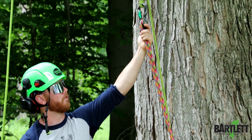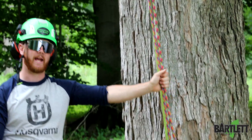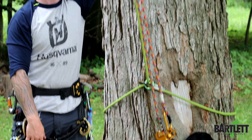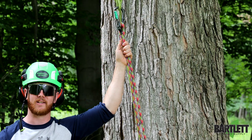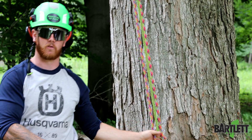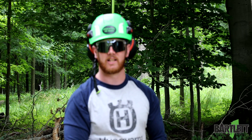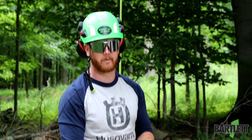With this revolver, we've installed a moving rope system for rescue. You can utilize this on single line as well — you don't necessarily have to have this — but depending on each rescue, you're getting less rope-on-rope friction with a pulley. We've installed the pulley there and have it on a zigzag system that you don't have to install more friction on. So I'm going to go up a couple feet into the air, and then Abden's going to step in and perform a rescue as it would be in the field if I needed to be rescued.